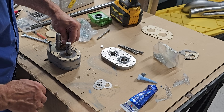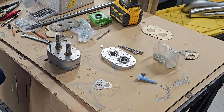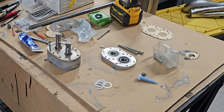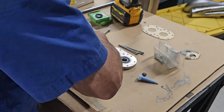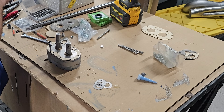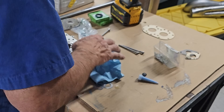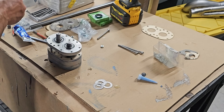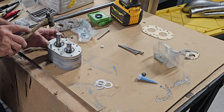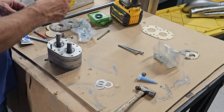We get that grease in there and go ahead and put this last bearing cap on. Between the bearings on the top and the bottom, we'll keep these shafts parallel. Those have been cut pretty accurately by the water jet. Most water jet cutters — you can tell them the degree of accuracy you want, and they can just turn the speed of the water jet cutting up and down to produce more or less accuracy. We asked for a pretty fine cut, which keeps everything nice and machine fit.